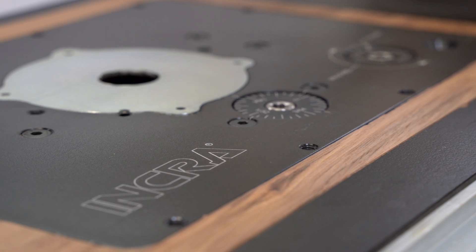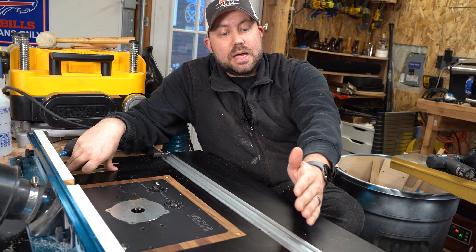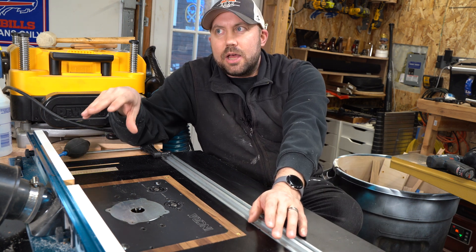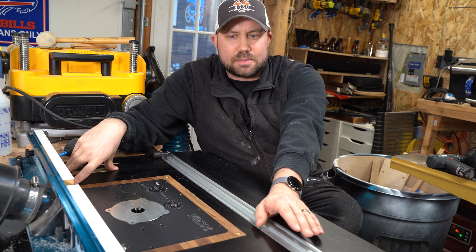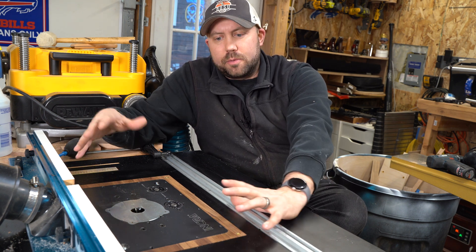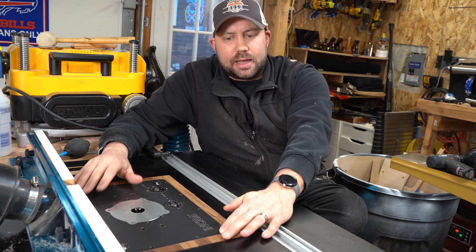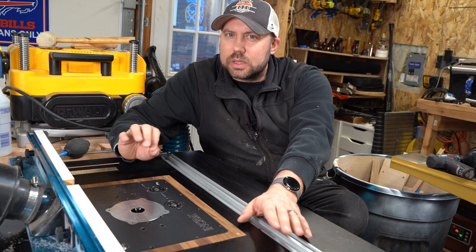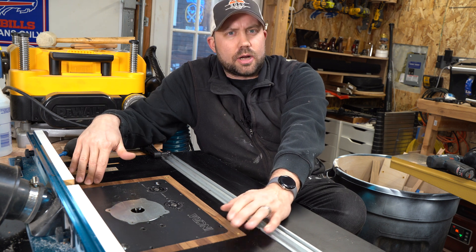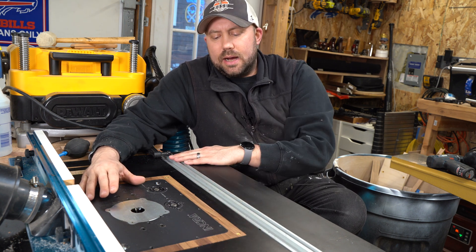The Shaper Origin was really helpful overall in helping me inlay everything and I learned a couple things along the way. The brass bars I bought on Amazon were literally one inch by twelve inches to the millimeter — great finds — but you can't cut your recess to exactly that same size because they just won't fit. Give it a little wiggle room on each opening and that lets you inlay with no problem. That also informed me when putting in the router table to give it a little more breathing room. It's not a perfect fit but it's really close and way better than it was. Part of growth as a woodworker is learning little things along the way. Thanks for watching — if you can subscribe that's great and hopefully I'll see you again.